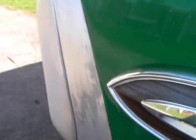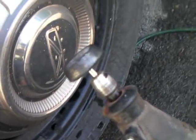I have a feeling this is going to come out really good. I did this piece this morning — I just ran it down with 320, then I used my Dremel with that little polishing wheel on it, which I never thought I'd use, but it actually works great. Put a little Mother's on there. After you do the 320, you can go 400 and 600, then just hand buff it and it comes out shiny. I did the 320, hit it with the Dremel, then did a hand buff. Not a whole lot of effort.